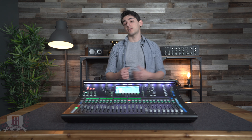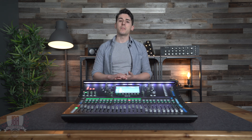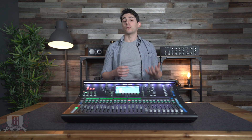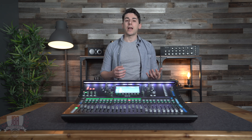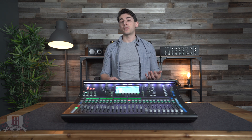The other way we can set up a streaming mix is to use one of our auxes, and this is the same way we would set up a monitor. This is useful if you have a different mix that you want to send to streaming rather than your front of house. Examples of why you would do this would be to bypass any kind of room tuning or delay on your main output, or you simply just want a different mix for your broadcast.